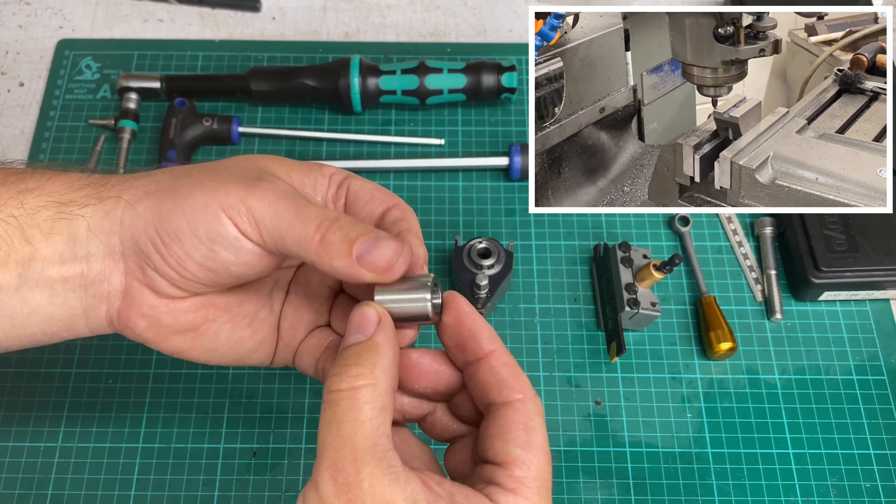I mentioned before this draft angle on the back here - that's purely cosmetic, it's serving no purpose really other than I thought it would look better as a design feature. And then it has these counter bores for the M6 screws, which then coincide with these holes that are tapped into here. This is cast iron, this is stainless steel. I also used a hacksaw just to put a corner relief into here, because otherwise there would be a small corner radius from the cutter and I didn't want that to foul with the corner of the T-slot and have a stress concentration there.